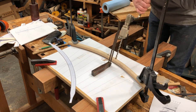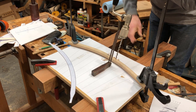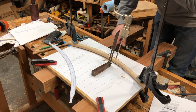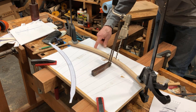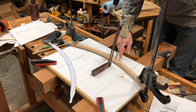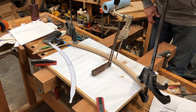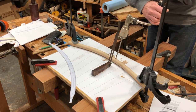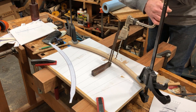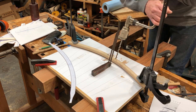When I calculate the angles in SketchUp, there are slight variations: 105.5, 106.4, 105.6, 105-point-something. I'm not trying to go to tenths of a degree here — I'm close enough just using 106 all the way, and that should be accurate enough for this kind of work.